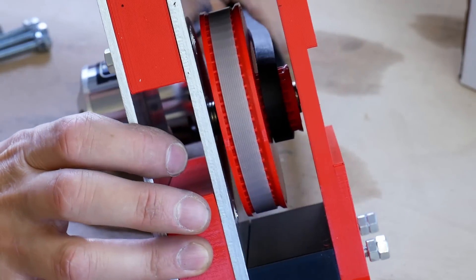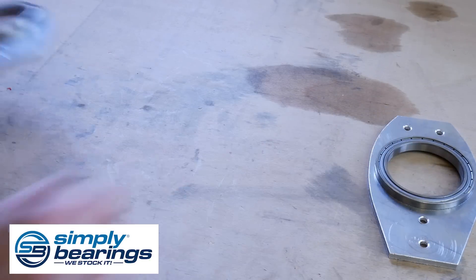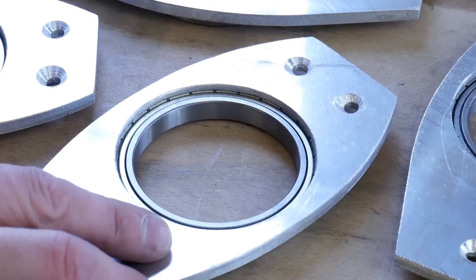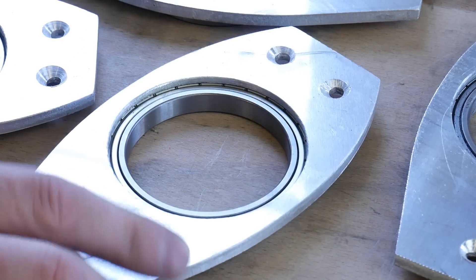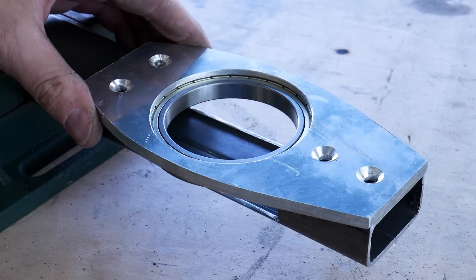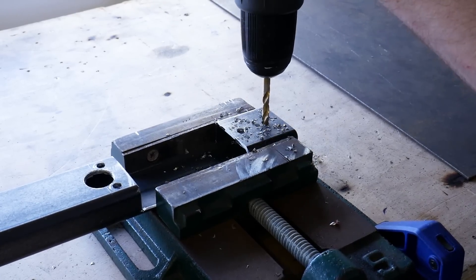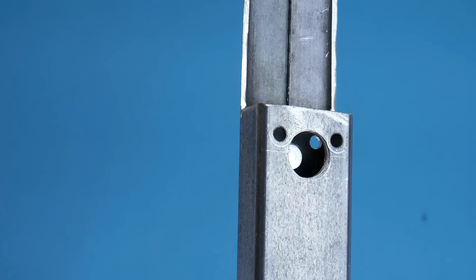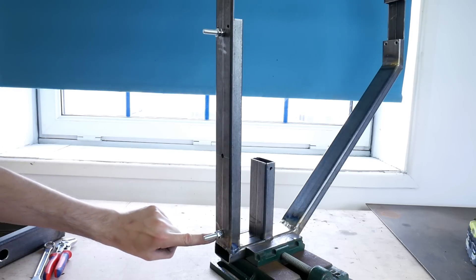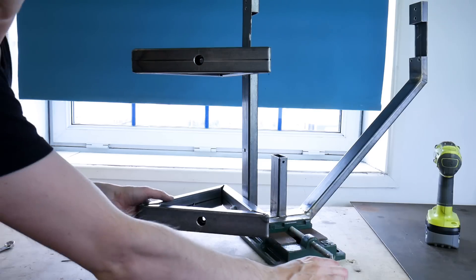I've made three of those for each of the three wheels. Thanks to Simply Bearings for the bearings — not only six to hold the axles but another 12 in the hemispheres of the wheels. I cut a high tolerance recess in the aluminium plate, a 3mm recess that the bearings push into nicely. I need to bolt those plates on so we need some additional 6mm holes for M6 bolts recessed on the aluminium side. There are two big hole-saw cutouts, one at the top and one at the bottom, which match holes in the triangular plate so the whole chassis can be bolted together in the middle with M8 bolts.